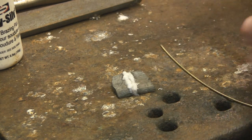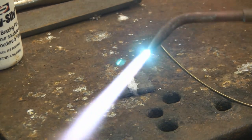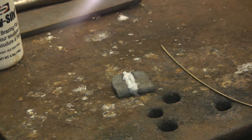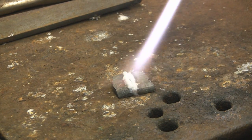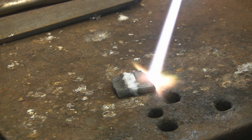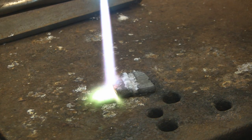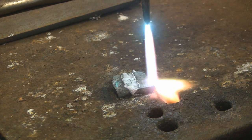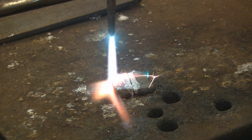This is what the silver solder wire looks like. I've snipped off a piece long enough to do what I'm going to do here. I believe my flame's just a little higher than what I want, so I'm going to back off a bit and bring it down to a neutral flame. I'll hold the silver solder wire in my left hand. What I'll do is heat the back end of the metal first, then apply heat towards the seam that I want to solder, working it back and forth on each side. Both pieces of steel need to be hot.